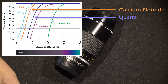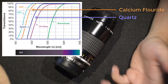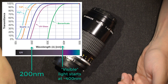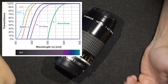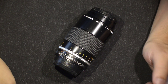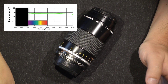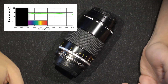You can see their transmittance — the point where light starts passing through the glass, meaning it becomes transparent — is around 200 nanometers, and reaches 100% transparency shortly after. For those who don't know, the visible spectrum — our normal life experience — happens between 400 nanometers (violet) and 700 nanometers (red). Everything below 400nm, invisible to us, is called ultraviolet.